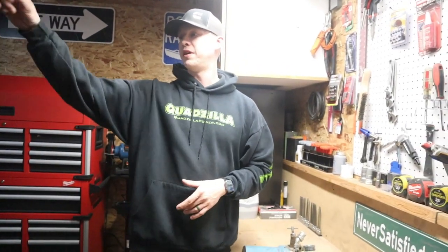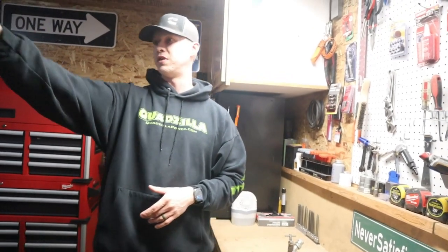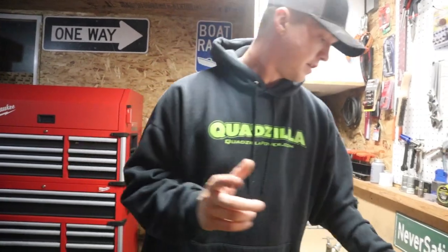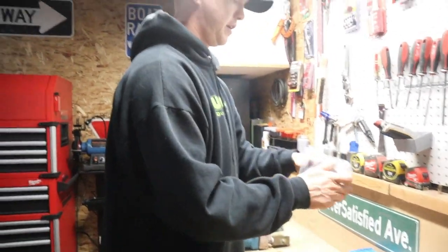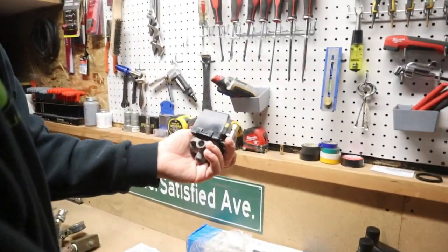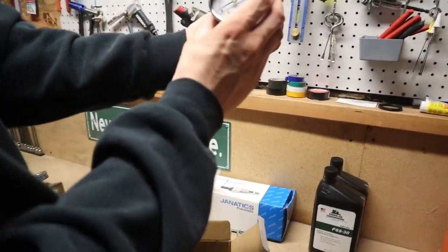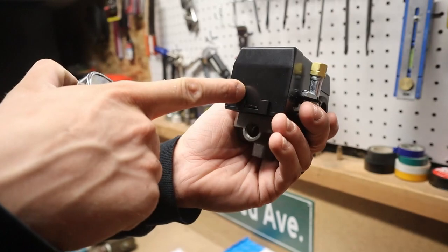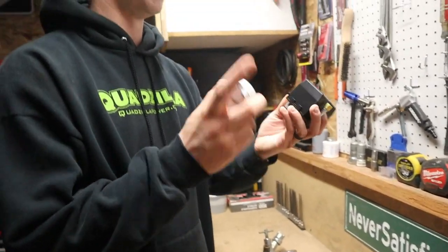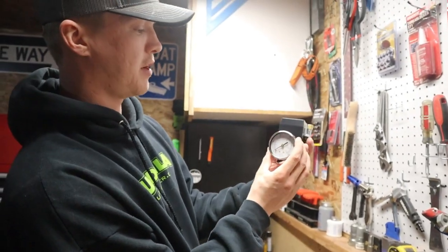I'm gonna get the pump and the motor on the tank right now, and then we'll start getting these things on. I got some plugs and everything, because on the pressure switch here, the new gauge will go on the front, boom, which this pressure switch is good for 125 PSI. If I need to go above that, I can just upgrade this later on, which is super easy. But my gauge will go on there on the front.